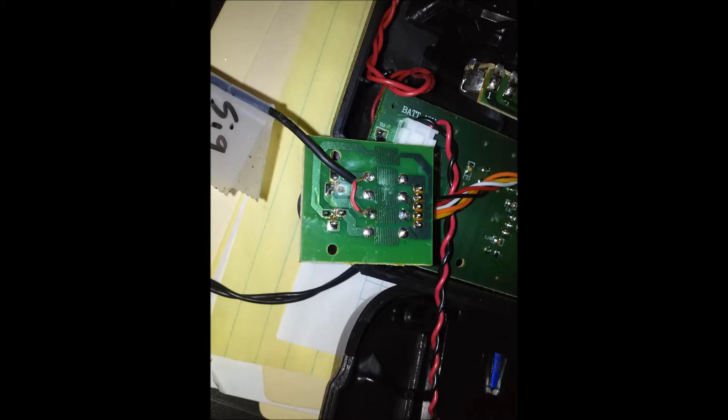When you get ready to solder the wires in your HobbyKing transmitter — or whatever transmitter you're using — you're going to take the screws off the back. This is a picture of the trainer port in the back of the transmitter; it's not screwed in or anything, it just comes right out. You solder your headphone wire in — you can see my headphone wire coming in — with the signal wire, which is a small red wire I've soldered on that pad, and then the ground wire soldered on the other pad.